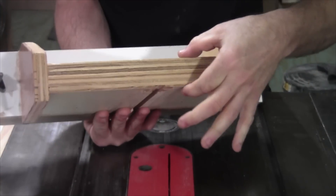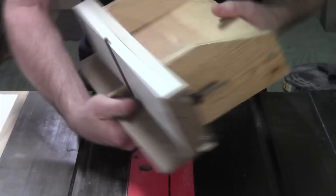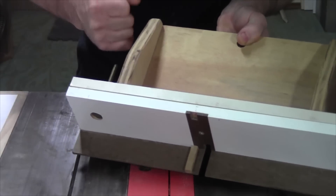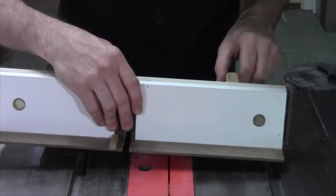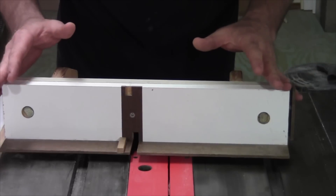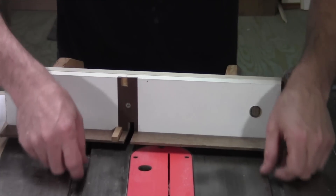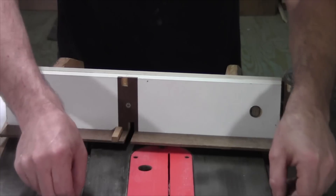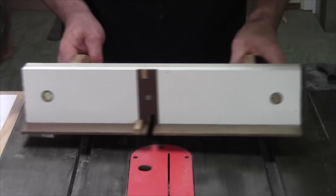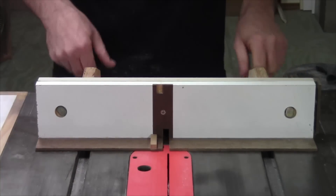The jig is just a couple of pieces of plywood — two pieces of three-quarter inch plywood and then our face. I used shelf doors or cabinet doors before, but I'm going to use some plywood for that this time. Anything I tell you about in this jig-making can be substituted to fit whatever you have laying around, or to accommodate your miter slot. You don't want to plane down plywood to fit your miter slot — that's silly — so you can absolutely use hardwood for that. Alright, now let's get into building one.